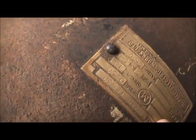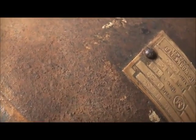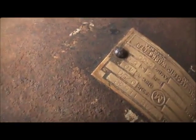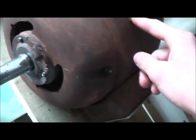I've got a bit of brass on this tag and buffed it right up. I started with some salt and vinegar and brushed it on with a toothbrush, and that got the heavy grey tarnishing off it. Then I cleaned it off and buffed it with some Robin Metal Magic, which is Australia's own made version of Brasso. Polished it very nicely. I'll mask that off carefully with some masking tape and paint this, mate, I reckon.